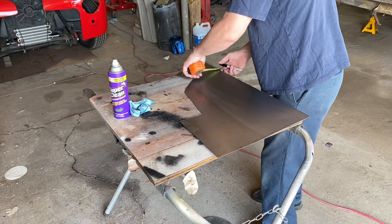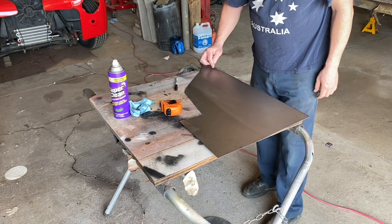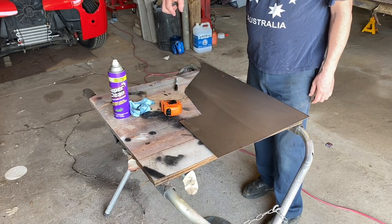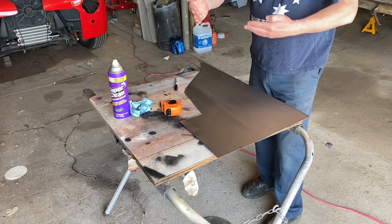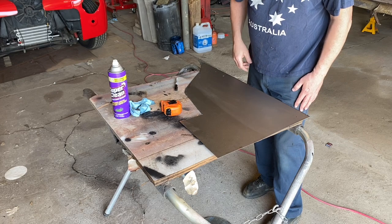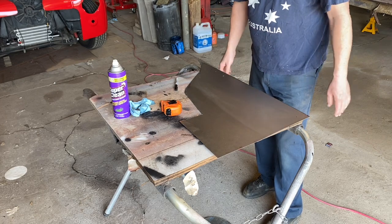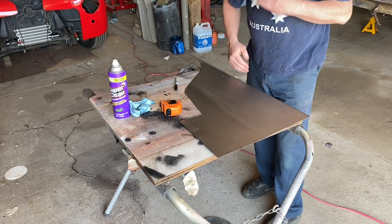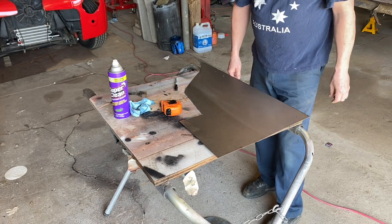Yep, because my bend is going to be at 3/4 of an inch in from the edge. And the reason is that the piece that I shrink will be about 1 inch, and then the flange on the bottom that I'll weld the cap to will be about 3/4. So not exactly the way I did it last time, but something I learned from the way I did the last one, that I wanted to have a little bit more flange up into the frame rail if possible.